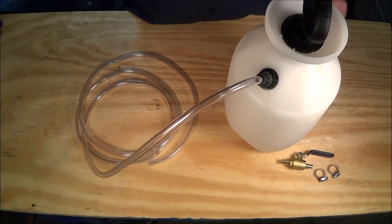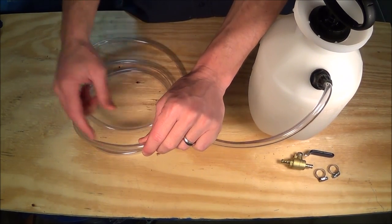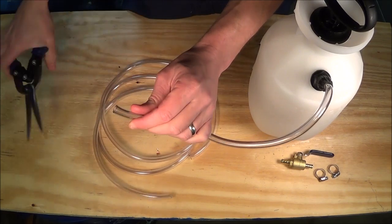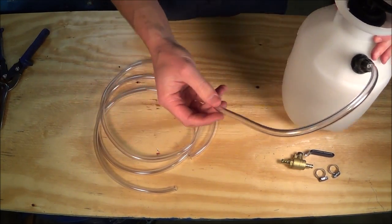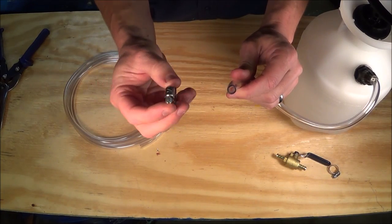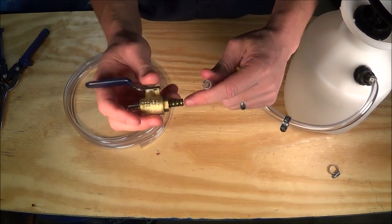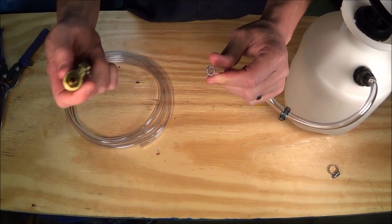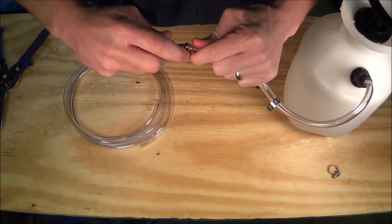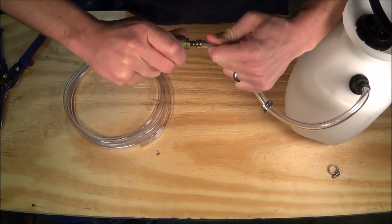The next step is to take about a foot to a foot and a half of this five-foot vinyl hose and cut it right here. I'll take my snips and cut about a foot down — now I have about a one-foot section coming out of the tank and about a four-foot section left over. Take one of your worm gear hose clamps, slide it over the end where it would meet the tank, then take your ball valve and insert it inside the clear vinyl hose. It makes a very tight fit — the hose clamps may not even be necessary, but for safety's sake I don't want any leaks.